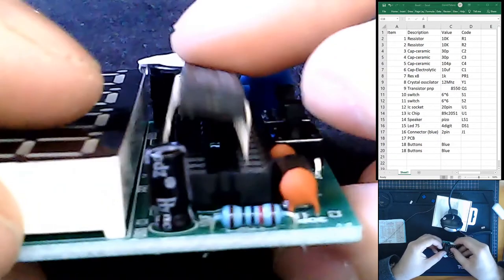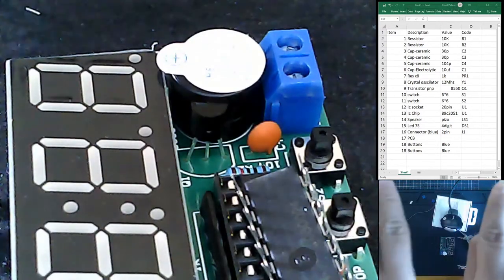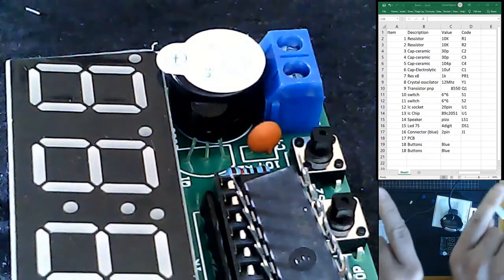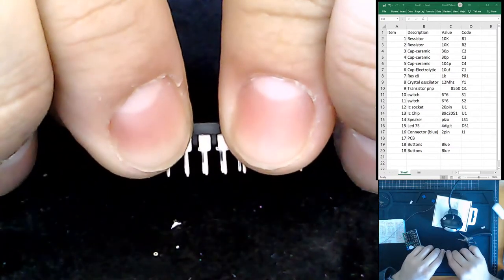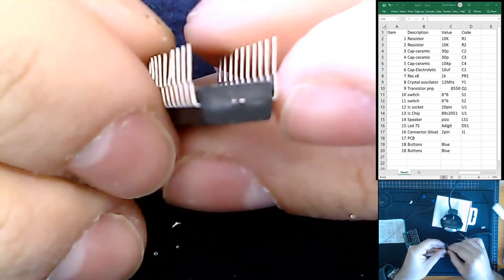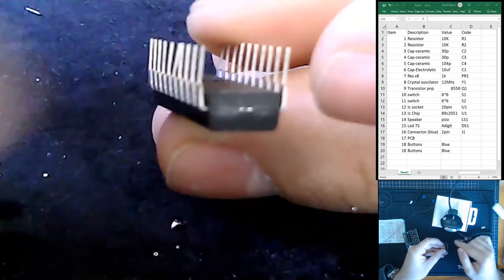Now you might find it's difficult to actually align it up, because the feet are wider. Look at the main screen. The feet have got to go in, right? And they're usually wider than they're supposed to be, so they're constantly pushing against the contacts, so you might have to slightly bend them into line. What I like to do is go up against some sort of table and push slightly, and now we see that the feet are almost parallel, as opposed to before.